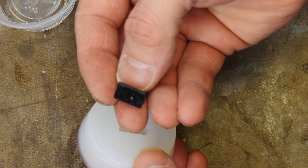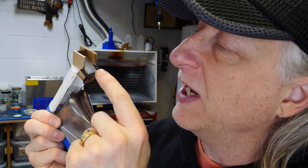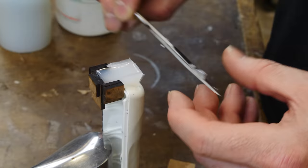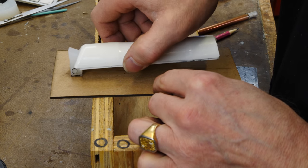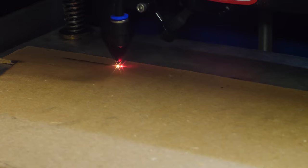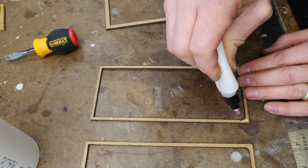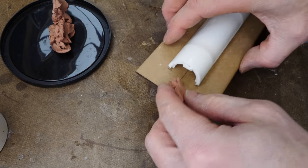This is the little key that I poured on top. I'm going to strip the cardboard off and we'll have our little key piece so we can make basically a three-part mold for this cover. The beautiful thing about the cardboard is it releases easily — check out the detail you get from just cardboard. We'll clean that up, mount it to the main splitter board, also out of cardboard, and use some PVA to attach the part. While that dries, we'll cut the key seal — the part that keys and seals the two mold halves together. There's an undercut built in that will lock the silicone halves together.